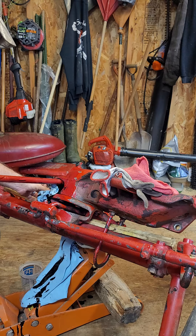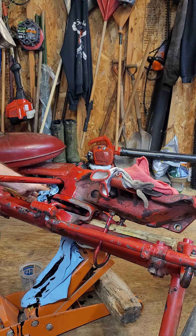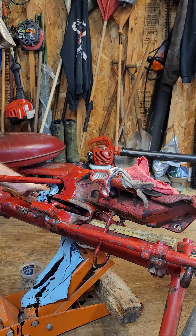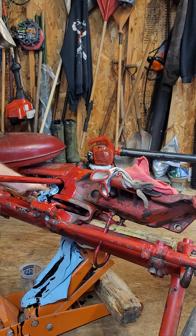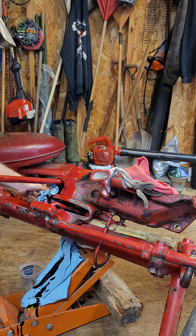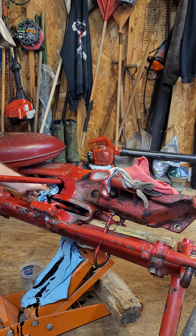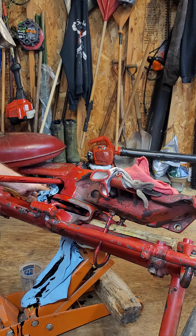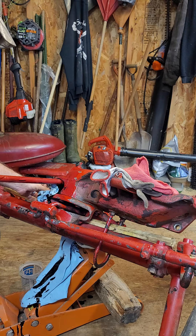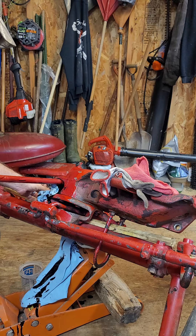It's a good possibility that most of the problem is this being loose. What I'm worried about is — I believe from what I've heard and seen — there's a keyway in here, and I'm worried about it being loose for so long that it egged out the keyway. The whole tractor is being rebuilt top to bottom, so it only makes sense to do this now rather than breaking it all apart after it's freshly painted. It came right off — I was going to use a puller but that's not necessary. In a way that's good, but that could be bad too. I'm wondering if this unit actually has to be broken apart before this comes out.